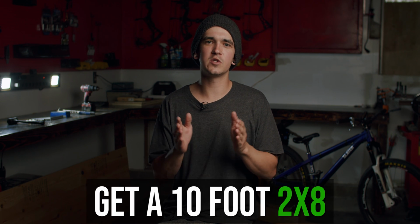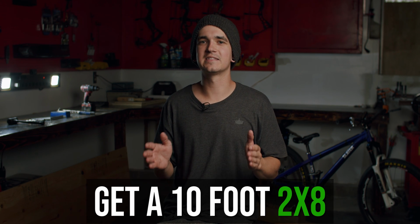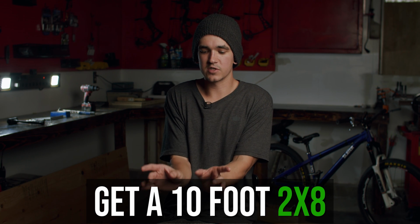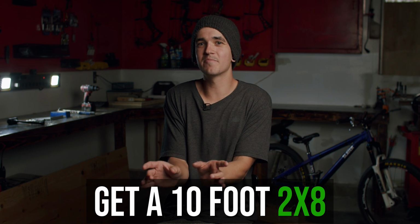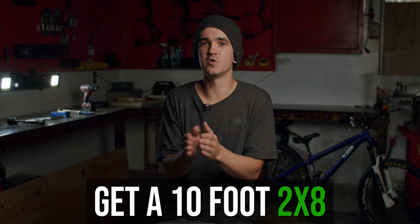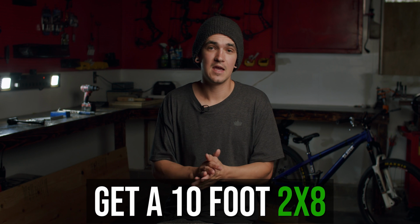All right, so I told you I would show you how to make adjustments in case these measurements don't work. Because as I said, this is for a 26-inch dirt jumper with 2.1 tires. So to start off, if your tires are wider than 2.1 inches, you're probably gonna want to use a base of a 2x8 instead of a 2x6, because once your 2x4 side supports are flush with the edges, anything bigger than a 2.1 tire is probably not going to fit.